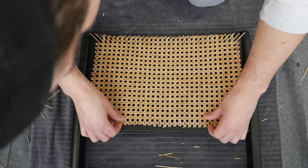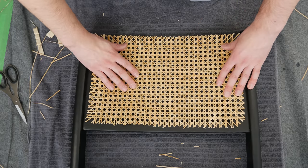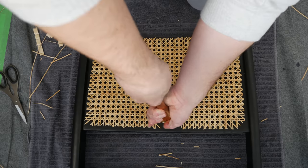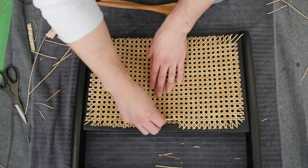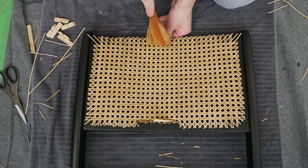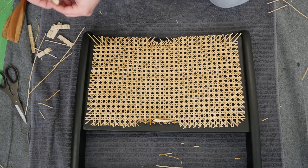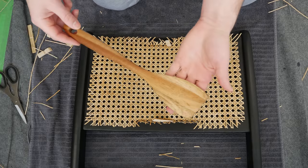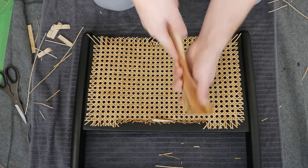One thing you don't want to forget is lining the cane up nice and straight. I just took one line and lined it up perfectly with the bottom crevice before pushing it in. The best tool I found was a wooden spatula from my kitchen — it worked perfectly for pushing it down. Any metal spatula or similar tool would work fine; it just needs to be skinnier than the crevice and not sharp enough to cut the webbing. As you're pushing the cane webbing in, it's nice to have something wedged in — I used clothespins broken in half, jammed into the cane webbing to keep it tight and in place.